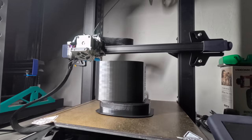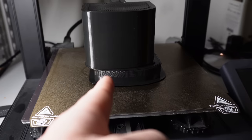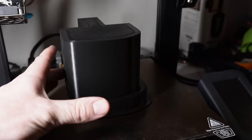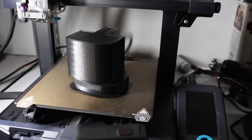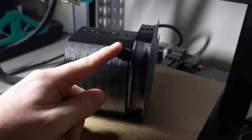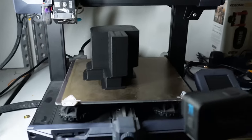So the bed plate shifted mid-print overnight and caused a layer misalignment. As you can see, it's pretty blatantly obvious. It's frustrating because I used 700 grams of filament for this dense print, and that's the last spool I have right now that's new and can actually do this big of a print. I think I can still save this thing by cutting off the excess and using the profile, but it's disappointing. Next time I gotta clip my bed down, I guess.